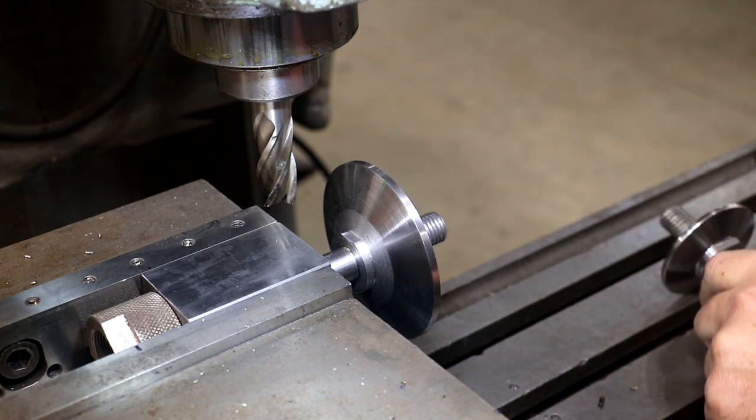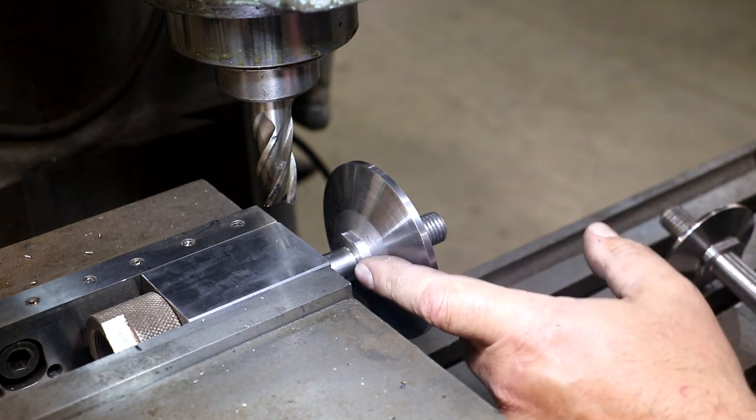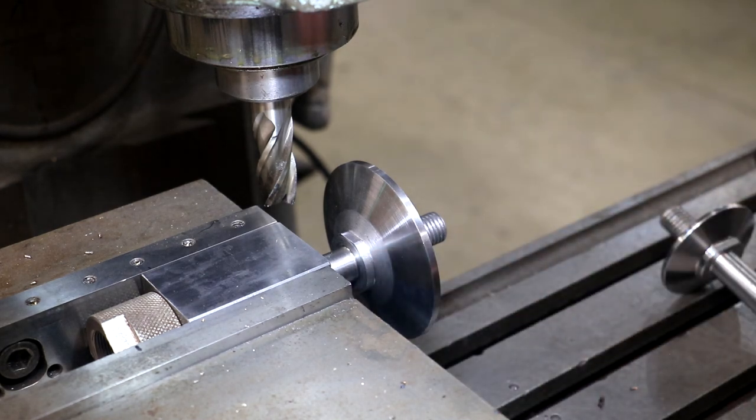And so we're going to start with 0.995 inches. We'll subtract out what we had there. Divide that by two. I got 48 and a half thou. So I'm going to do 48 thou more on each side, and I think we'll be right where we need to be.